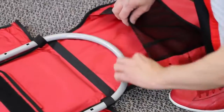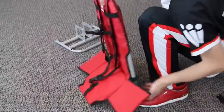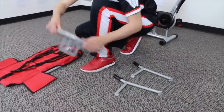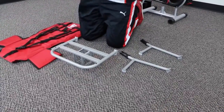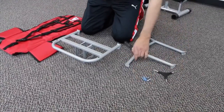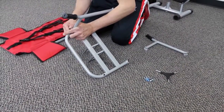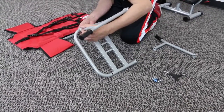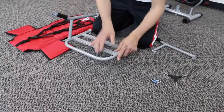You're going to insert the bar into the cradle. Next, take the seat base and install the arms. This is where we're going to need our number 4 Allen key and the 6 seat bolts. The best practice is to gently hand thread the screws in first, then use the star pattern to drive them home once they've been gently hand threaded in.